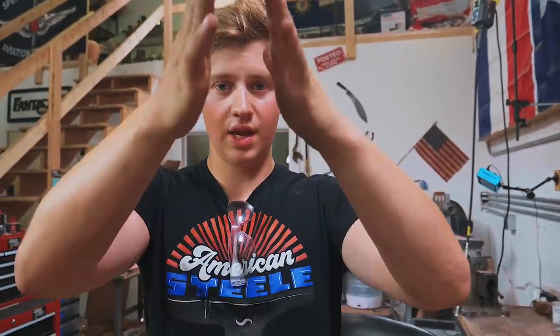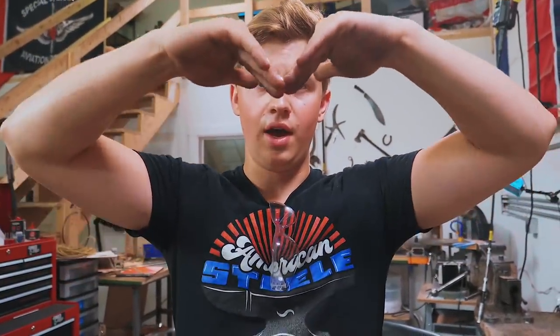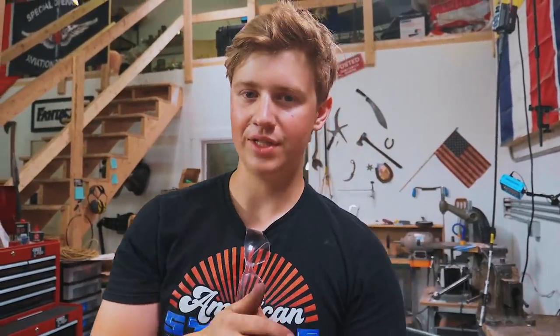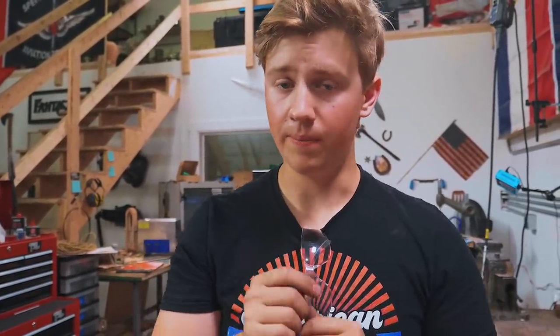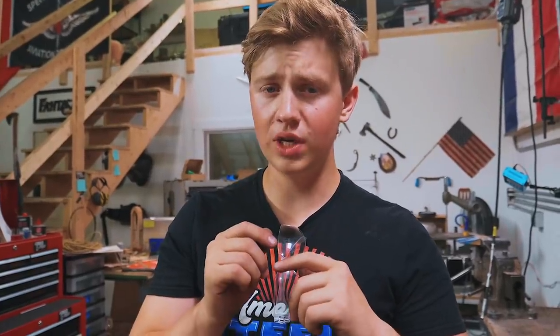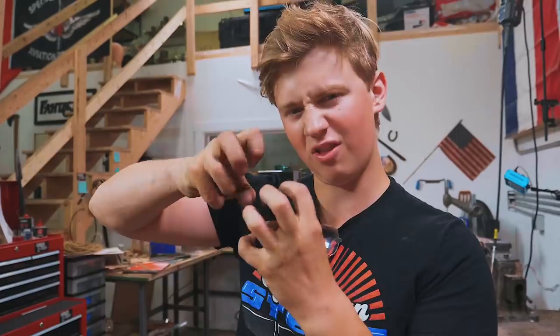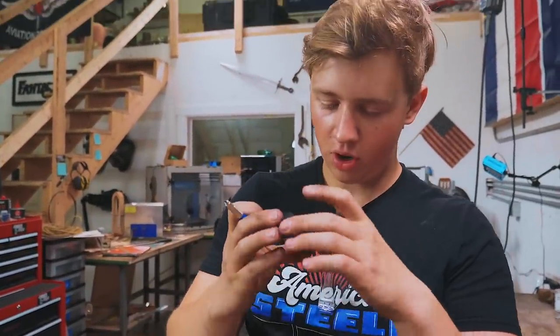Flutes can either go one of two ways: they can have hollows carved in for the flutes, or they can be round lumpy flutes like we did on the cavalry saber — but on the cavalry saber we only did one flute going around. This is going to be four flutes going around at the same time, so it should look really, really nice. It's going to be kind of tight — we'll be able to press that wire wrap in and make it look really cool. So let's take a pencil and work our way around.